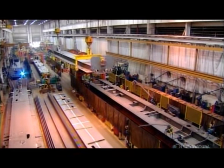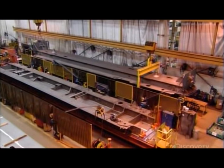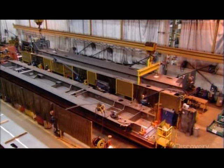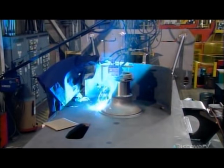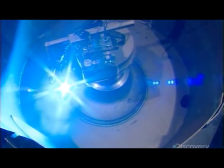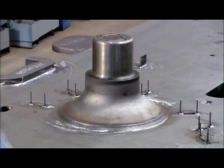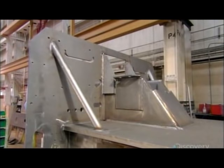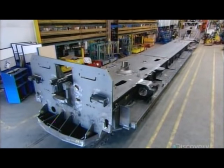The pins require exceptional bonding because they connect the underframe to the wheel frames. An automated welder circles each pin repeatedly, progressively building up a 2.5 cm thick weld. They make the same size weld on the other side of the pin. All the welded steel parts are exceptionally thick, rendering the underframe strong enough to pull 454 metric tons.